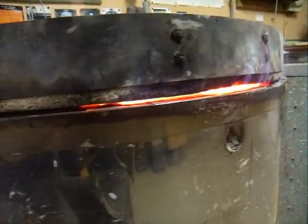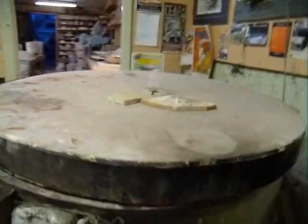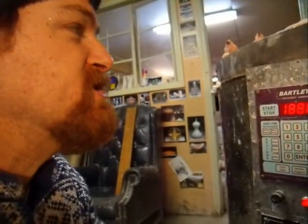I'll go around the kiln stuffing the cracks. This kiln has pretty good back pressure, so we'll fill any of the cracks we see in the lid. We're at 1888. We've been in reduction now for about an hour and 45 minutes, so we're chugging along.